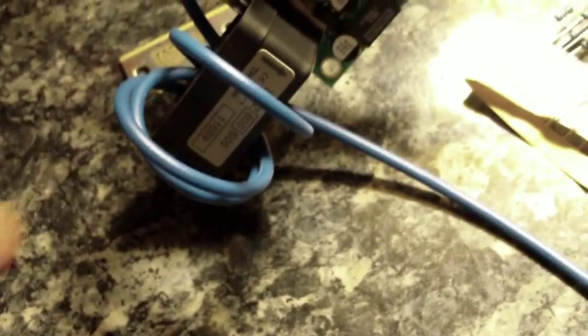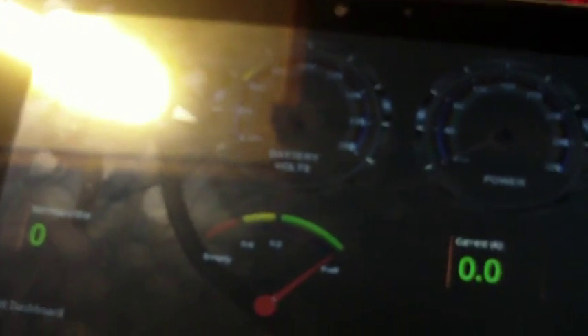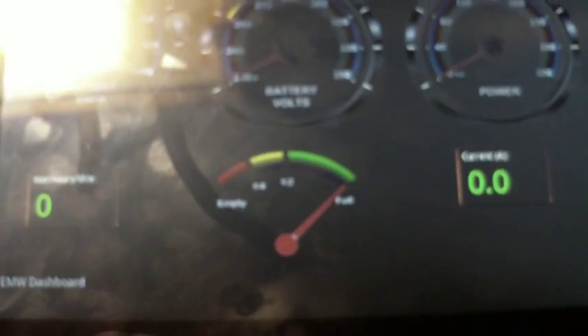On the actual sensor board, what I've done just to test it — I don't have a pack voltage set up, but I just put some cable through the hall sensor about five times. I've got a little 7 amp-hour, old gel battery, 12-volt gel battery here. I've been pretty much just shorting out the gel battery through the turns through the current sensor, just to see if it caused the gauges to kick — and indeed it does.